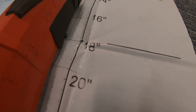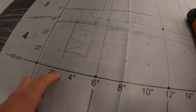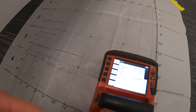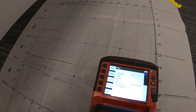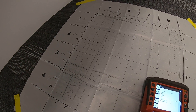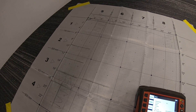That's how the grid sets up. The mat has all these markers on the sheet itself so that if you have a known location of a piece of rebar — because the scanner is going to show you that piece of rebar is at this X value, this Y value — you can use these values to find it on the map very quickly. The mat is also meant to get dirty.